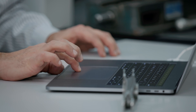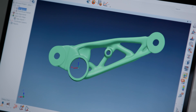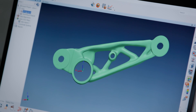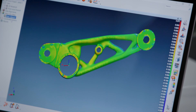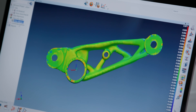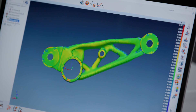Let's take a look. I first want to show you the 3D model of the optimized part. The first thing we'd do is sort of look at them together, and you don't really see much — they're basically on top of each other. For each point in the point cloud, we measure how far it is away from the actual 3D model, the design intent model. What we'll do then is colorize this model based on what that deviation is. So what we're looking at here: the different colors show you how far that area is away from the actual design intent. The color scale on the right tells you red would be really bad, purple would be bad in the opposite direction, and good data is kind of here in the middle — green and blue — which is mostly what we're seeing here.